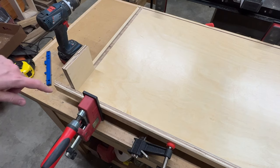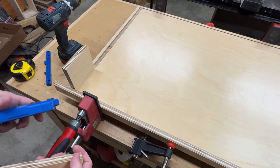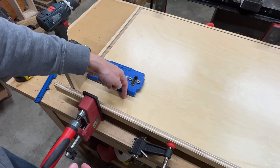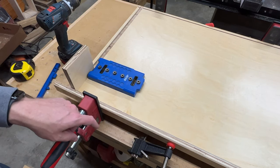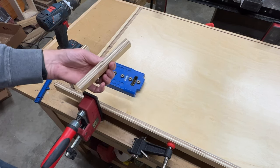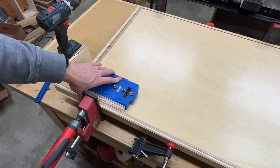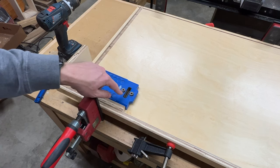The pantry cabinets are about 24 inches deep. For the shelf pin holes for the top cabinets, if I use the standard fence that comes with the Kreg jig, that leaves my holes about an inch and a half in from the face. Because these shelves are so deep, I'd like them in just a little bit farther. So what I've done is clamped a three-quarter inch piece of plywood to the face, and then I've got another scrap piece here that I'll hold my Kreg jig tight against when I drill my holes. That gets me from the standard inch and a half closer to two and a half inches in.